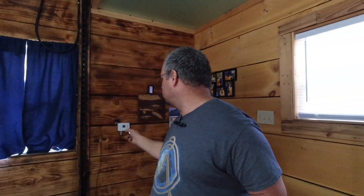You'll also need a power supply. If you're in a vehicle you could use a cigarette lighter plug that plugs directly into your 12 volt port, or you could run it straight to the battery with a fuse. It's not going to pull very much at all — the only thing really running is this relay. You can see it behind me here. I've got it all set up and I've actually tried it out and it works.